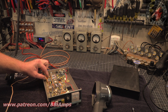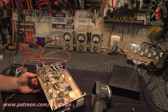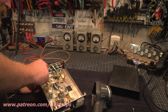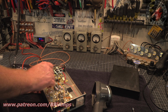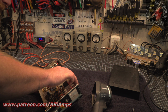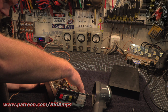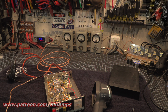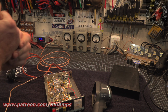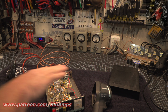I see that they've changed this capacitor here. Please be 103s. What are you? 103s. Cool. We might be able to do the high power mods to this thing. We'll see. Okay. Power wire and preamp first, and then we'll come back, we'll do transistors.